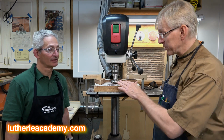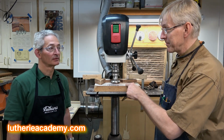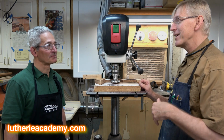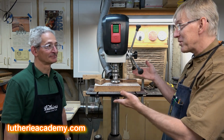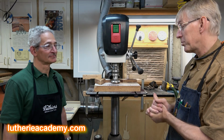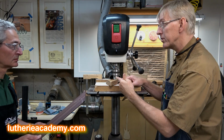Now, the top I don't do in the safety planer. It's a softer wood. I either do it by hand or put it through my sander. But the back goes through here. Now, before I learned that concept of working efficiently, I would clean everything up, I'd break down the tool, I'd put it away, and then a few hours later, I'd pull everything back out. Well, if we do it now, it saves us a bunch of time. 10 or 15 minutes over the course of a week is a half day. So we can save ourselves probably a half day of work just by working efficiently like this. Just push it and pull it out, we'll put it in the calipers. If we like the setup, we'll go ahead and, as James Brown says, take it to the bridge.